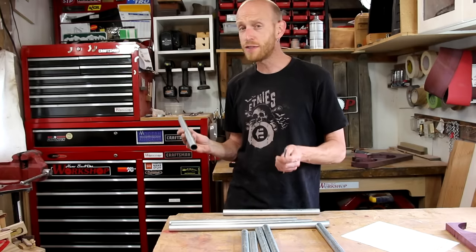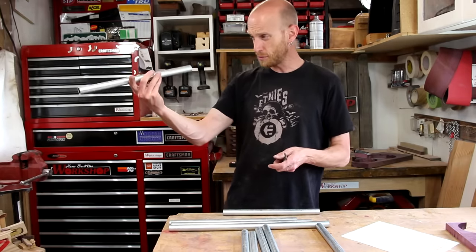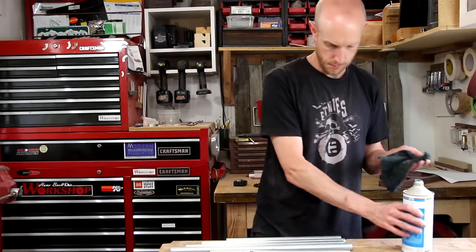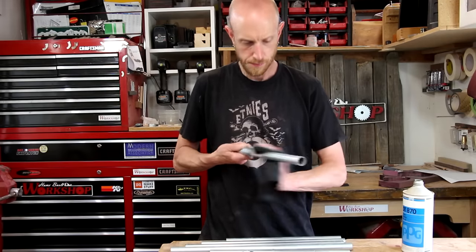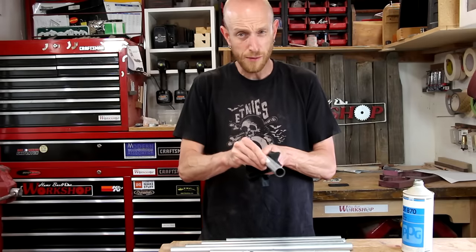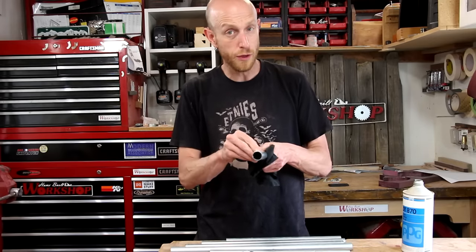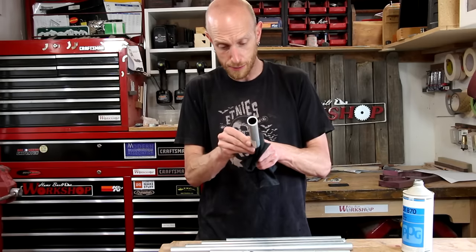It's kind of hard to see down in there to see if there really is a burr, but you can look through the tube and see if there are any sharp edges sticking out. I'm just going to use some lacquer thinner and wipe down the outside of these conduits to remove any dirt, oil, or grease that could contaminate the paint we're going to put on. We also want to peel off these barcode stickers — the lacquer thinner will help dissolve the glue so we can get those off, because we sure don't want to paint over top of a sticker.